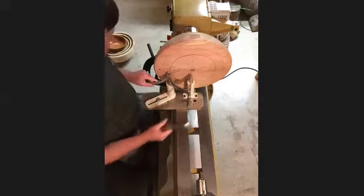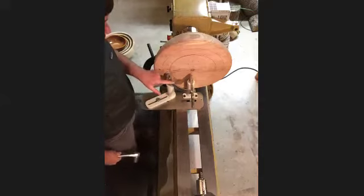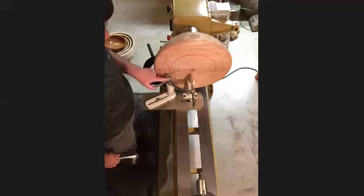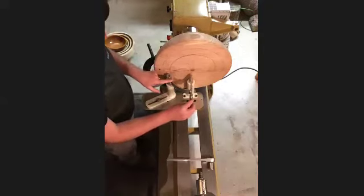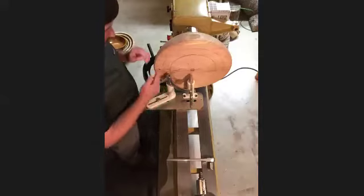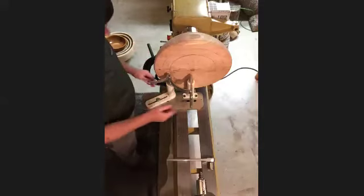And then you'll see we have to move it. Generally, I cut up until the knife, there's this dropping point. Beyond that, it's not supported as it's going in the wood, and it may chatter, could do nasty things. So you then use the knife support, get that in place, and that's going to support it the rest of the way. I'll be adjusting as I go.